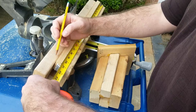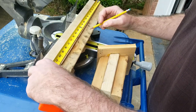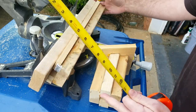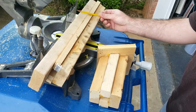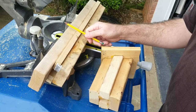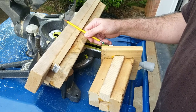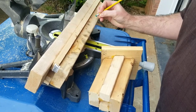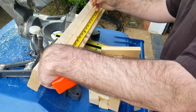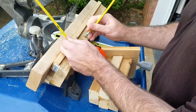So then what we need to do is make diagonals. Now, being that this is 21 inches long, I can get easily 7 inches. However, that diagonal, if I use this as the bottom and this is the bottom, I'm going to have 2 diagonals, which will leave one of these without a flat bottom. So then I have to cut that flat bottom off, and then I'll lose 1.5 inches. So if I divide that 1.5 by 2 and move these marks 3/4 inches each way, hoping I can get close to equal sizes for each one of them. So we need to divide 1.5 by 3.